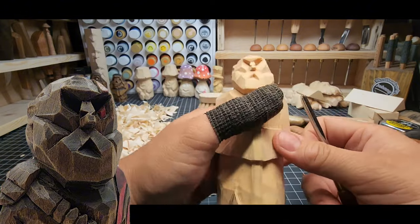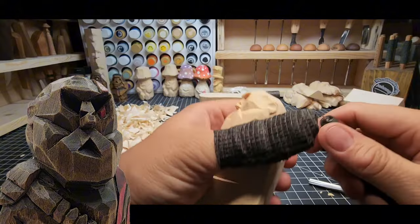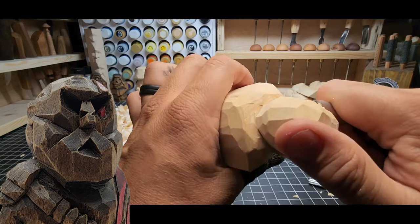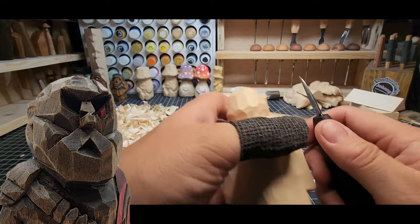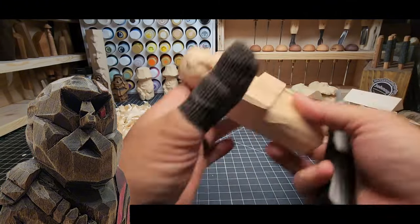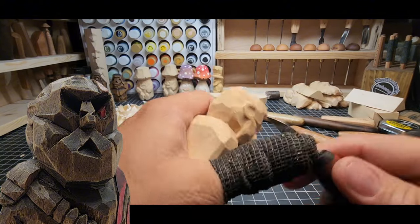A u-gouge — not v-gouge, a u-gouge — just to scoop into and out the back of the ear. Nice and easy, just that little bit of detail, nothing crazy. I'll use this detail knife to round out those ears a little bit — round out the top and the sides and the back of the ears, smooth them out a little bit. You can see it's just a scoop out of the ear, right — just into it a little bit before the ear and then right out at the back of the ear, leaving a little line around the edge of the ear. Nothing complicated, nice and easy. Now we're rounding off the back of that beard just a little bit on both sides.